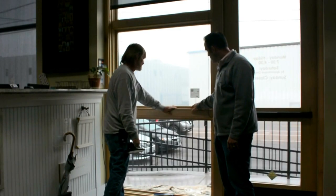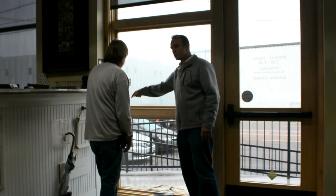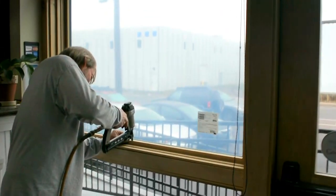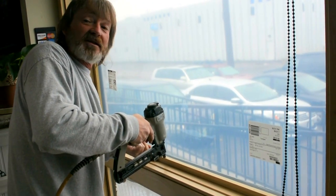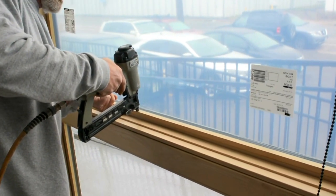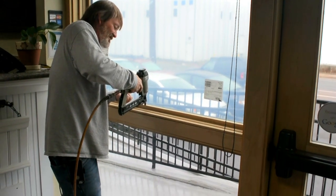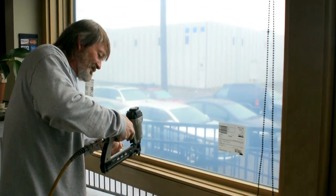The one thing we do need to do is put some finish nails in. Randy's going to fire up the air compressor and put some finish nails, so when you do reglaze the glass, you need to have that compressor and those tools with you to properly do this. Randy, what can you really screw up here when you're doing the nails? If you get the nail at an angle, you can hit the glass and basically break the glass. With this tempered glass, you just hit that edge and the whole glass is wasted. We did all this beautiful work and it's perfectly sealed — if that nail is angled wrong, it's all wasted. The key is to make sure you're shooting it back or down. Don't angle out toward the glass and hit that piece of glass.